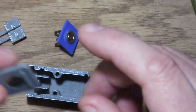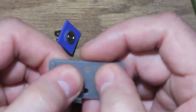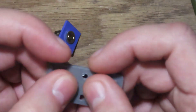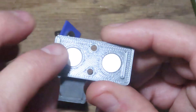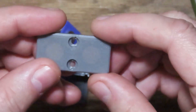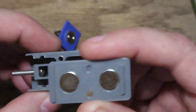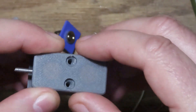Once you've got it all assembled, you'll take the cover and insert the two 10mm by 2.5mm magnets into their pockets. These should press fit in just fine. If they're loose, put a drop of super glue into the pocket before you insert the magnets. Make sure their poles match so they're both on the same side - north or south - on the bottom. Then install the cover: the narrow centering pad goes to the back and the wide one goes to the front. Then screw in the two M3 by 8mm screws to hold the cover on.